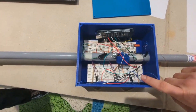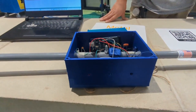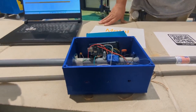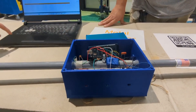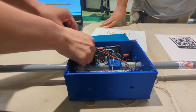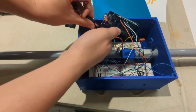The second portion of our circuit is the sensory portion. It's connected to three indicator lights on the front here. You have blue, green, and red, with blue being the weakest, green being medium, and red being the largest. These indicator lights show the magnitude of the difference in frequency registered. So if we have a metal that's very large or very close, the change in frequency would be greater, showing the strength and giving you a more accurate interpretation of what's going on. For convenience, we also have a buzzer, so you get an auditory indication as well as a visual indication.